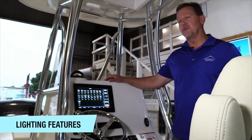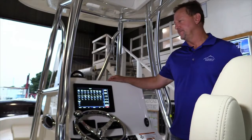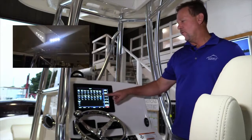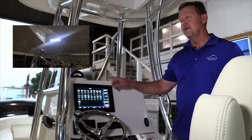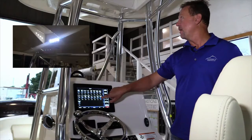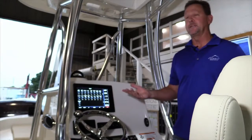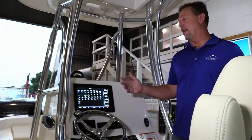One of the unique features of C-Zone and Garmin is the dimming control feature available on each of the lighting buttons on this boat. For example, your forward spreader light — I've got an individual button for it. When I turn it on, the light turns on at full power, and once it's on, if I hold the button down, the light begins to dim. I can release my finger and the light is dimmed at that position. If I want to increase it, I put my finger back on it and it increases the intensity. I can raise it all the way back to full or stop at some position below that, then just hit it again to quickly turn it off.